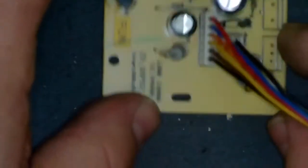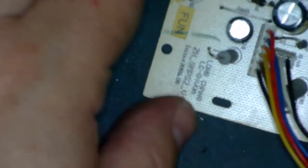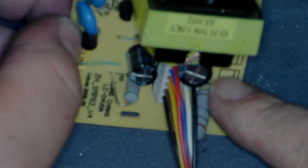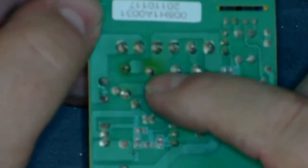So this is a different core material, different dielectric, different silkscreen color, right? We're black on yellow now. There's no solder mask. It's a pretty decent silkscreen layer. I kind of like that. But almost everything is through hole, and it's all on one side. I do see a little discoloration here. I guess that's around one of the transformer pegs.